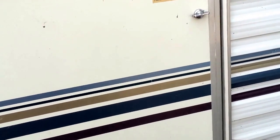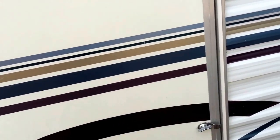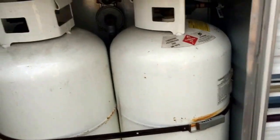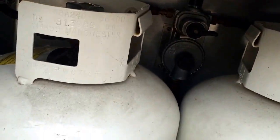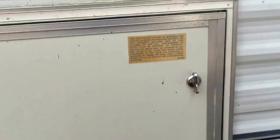You don't bypass your hot water heater because you're using it as a tank. So the plug I pulled out to drain it, I'm going to put back in. That'll hold air in it. As I'm pumping air through my lines and building pressure, I go to the farthest point — which would be my bathroom — and start opening lines up. It blows all the water out. It's kind of slow, not as fast as running antifreeze through it, but you're guaranteed to have no water in your lines. Also, make sure your gas is shut off.